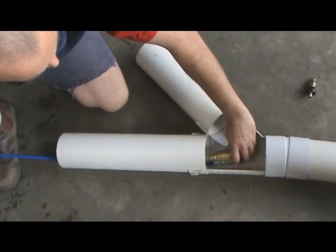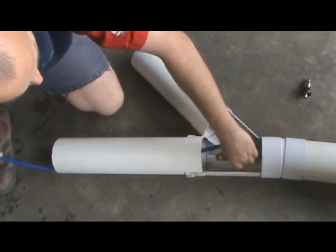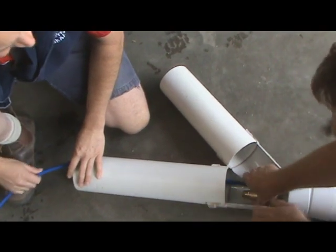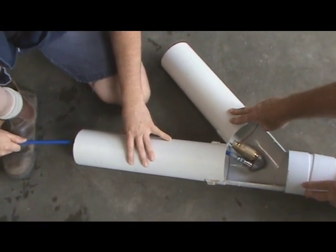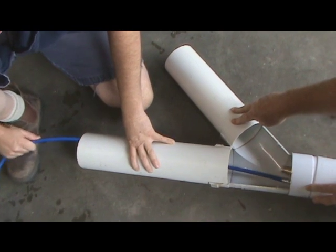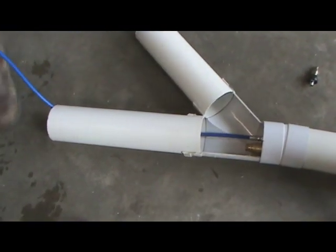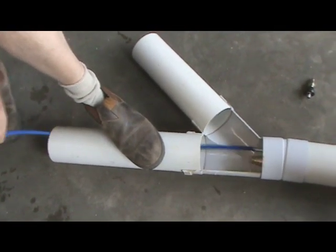So if you twist when it's going down and it's sitting up at an angle at this position, it has a little twist, up it goes - and see you later. Sometimes you get them out, but sometimes you don't. If you're really unlucky and you're twisting around, you can get stuck on the V there. Always let it go, or pull the hose and let it snap back again, then have another go. If it gets caught there again, pull it back, give it a good twist, then pull it back and it'll miss it. So it's all about feeling what's in the drain - a little bit like fishing. Just have a good feel of it and you'll know what's going on.